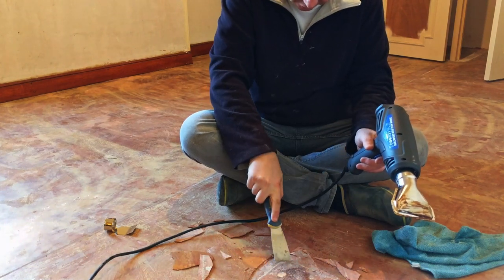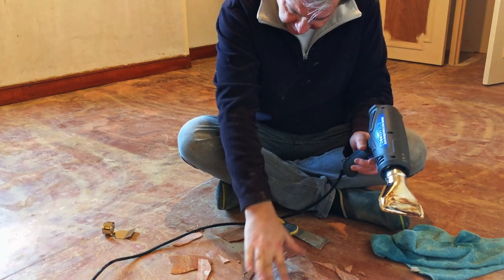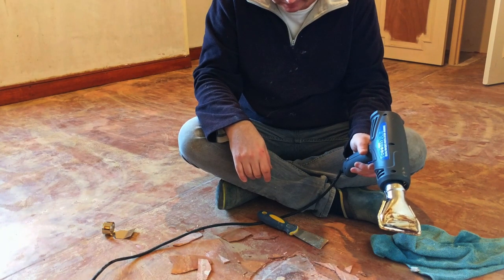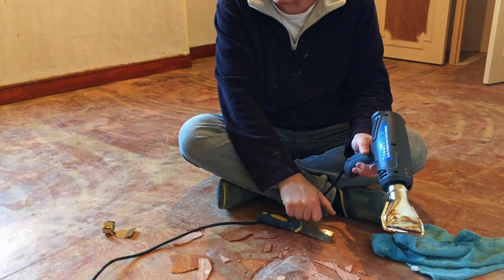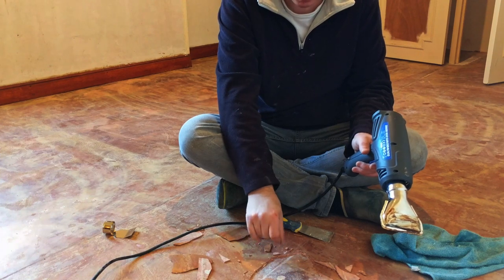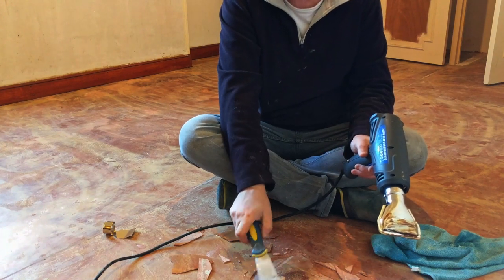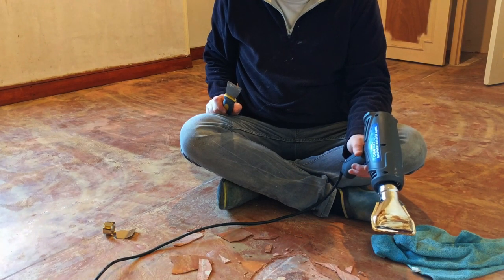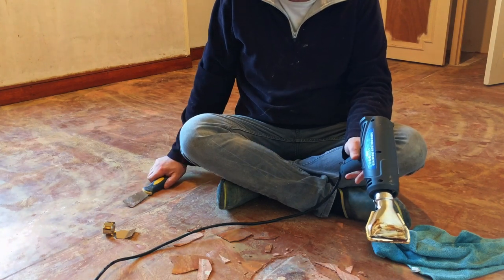Looks like it might be taking the top of the surface off a little bit, but it's still a tile. I mean, there's a lot of old stuff on there. I'm hoping it'll be good enough. What I'll probably do is sand this and get back to what it was. We've got to clean these tiles all up anyway, and there's no porcelain on them or anything like that. They're just terracotta and porous. So if I get this off, they'll save this floor, and depending on where the broken tiles or patches are, I have enough of them to do a pretty good section, and hopefully can match it all. Let's do that. But so far, this is very encouraging.